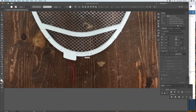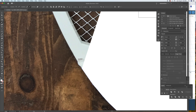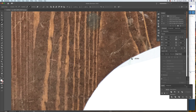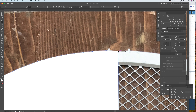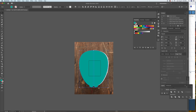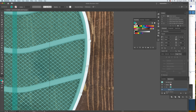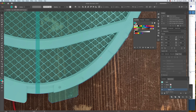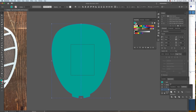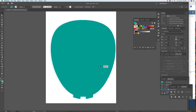Starting at the top center, I use the pen tool — or in Photoshop I would use the polygonal lasso. Then I hold Shift, which forces me to draw a perfectly vertical line all the way to the bottom. From here, I just start dropping points as I trace the outline of the shape. I'm drawing straight line segments around a curved shape, so I drop points more frequently around sharp corners to keep the overall shape looking curved and less like something out of Minecraft. Once I complete the shape, I copy it and flip it horizontally, then drag the new half to line up with the other edge. Shift is your friend here because it forces the move to only happen in one plane — it will not move up or down at all. I also change the color because it makes it easier to distinguish my shape from the white in the photo, and dropping the opacity allows me to see through it so I can get it lined up perfectly. Once the shapes are in line, I combine them using the Pathfinder panel — different programs will have a way to do this, it's just called something else. Finally, I input the overall length and width that I measured earlier to get my drawing to scale in one complete and perfectly symmetrical shape.